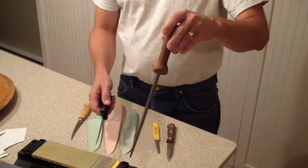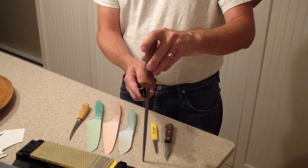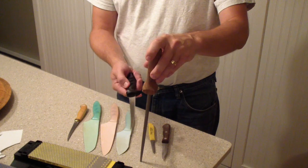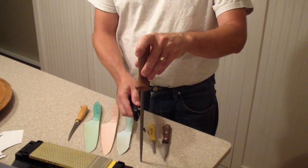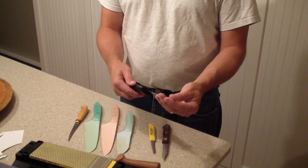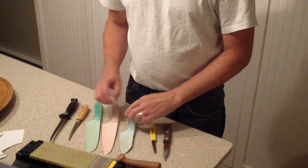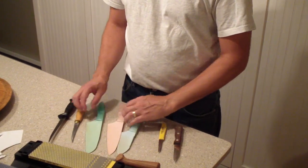And remember, after you've sharpened it on the sanding block, make sure you do a couple swipes straight down with this, a grooved steel honing rod. You can use diamond too, but steel is just fine. Just do a couple times like that, and it straightens out the curve, the grooves on the blade, and gets it real sharp. So after doing a bunch of them, really cheap knives don't work so well, but good knives you can get a razor sharp edge.